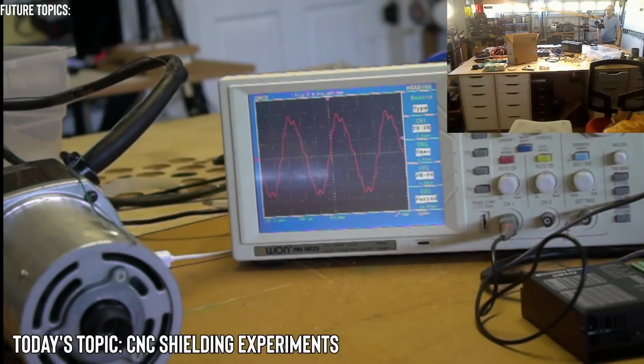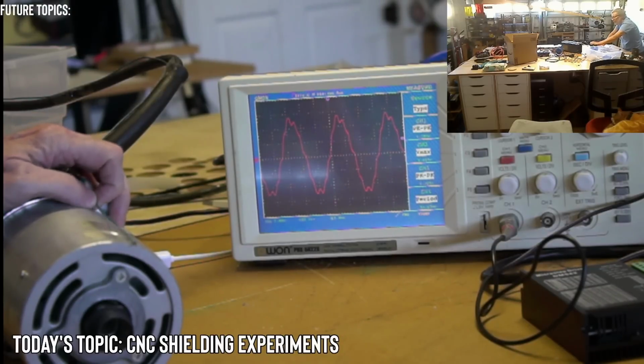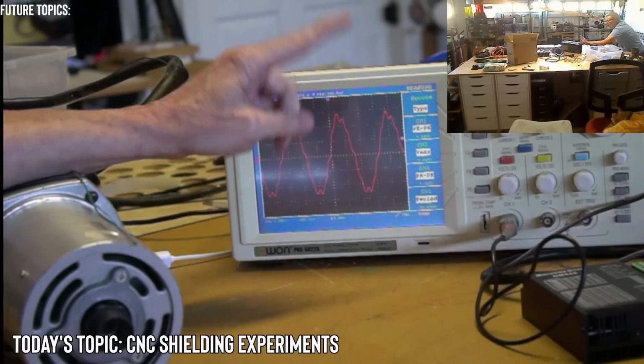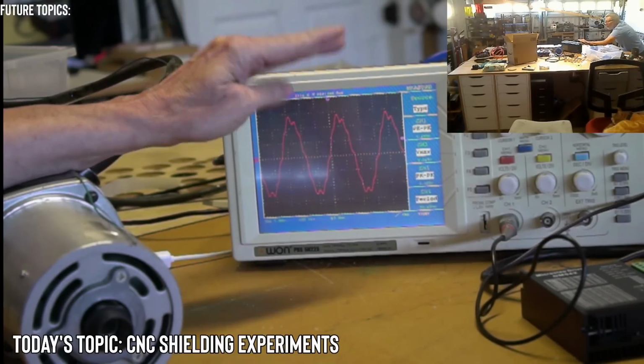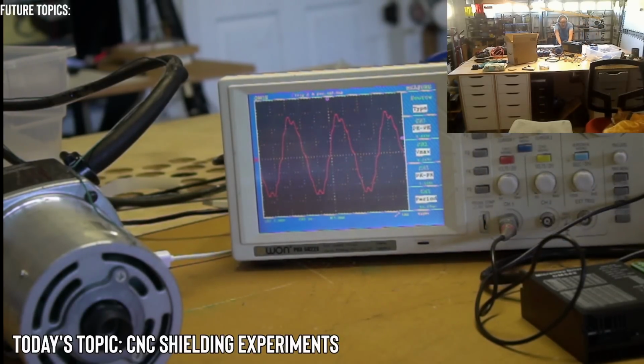But it's a very small wave, so not a big deal. But 5 volts, if you're running a line next to an AC line, sort of a delicate line for a limit switch, 5 volts will affect a 24 volt signal, because at the 0 it'll be like 2.5 volts, 2.6 volts, and at the other end, at the 24 volt high signal, it'll be another 2.6 volts, bringing it down. I don't think that really gets into the no man's land of where a controller can't understand the signal, but it's definitely something that's contributing. That could cause a failure because of other things adding to that.